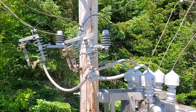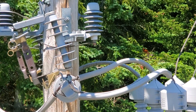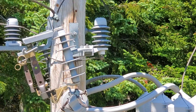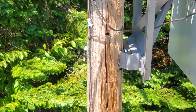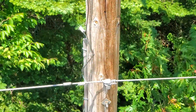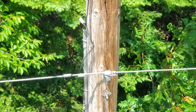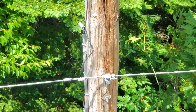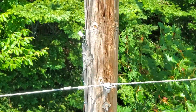You can see at the bottom of the lightning arrester, that piece of copper right on that brass nut runs over to the pole, and that is bonded down through into not only our neutral, but also our pole ground which is beneath that covered molding there. So we do run off a multi-grounded system here where everything at neutral potential is also bonded to ground.